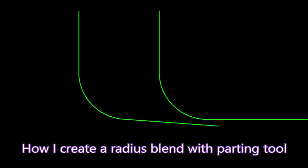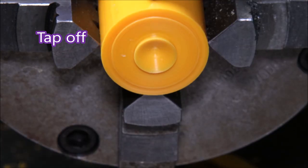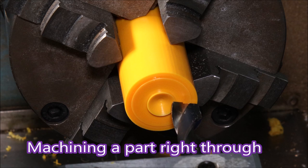Early on I found it almost impossible to get a perfect blend of the radius with the already turned part, so I use a tangent line for the tool path and take that into the radius. As usual, I tap this part off — in a second you'll see what happened to a part before I got it adjusted just right, and you can see that's a pretty nasty mess. Now we'll do a run through of the machining without simulation.